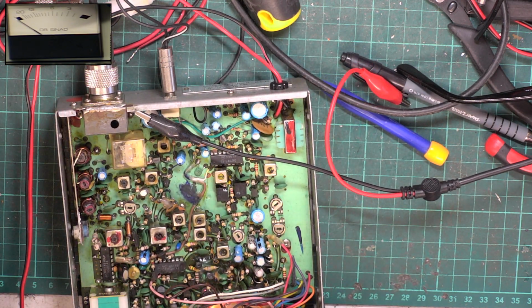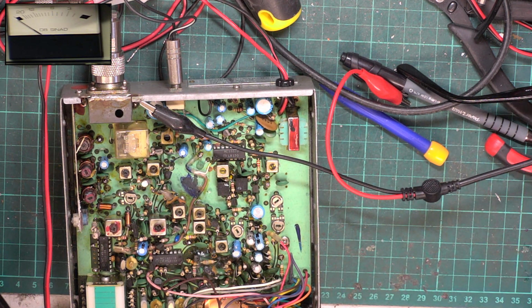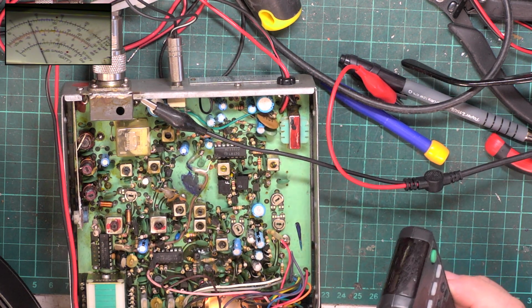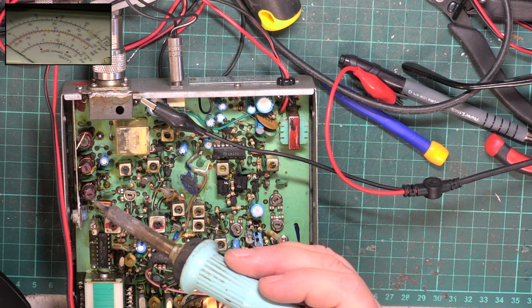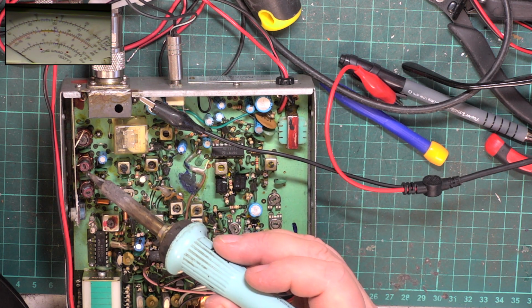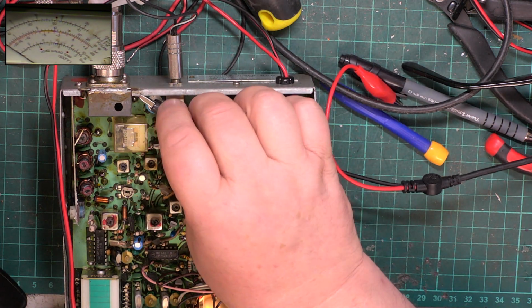Came out of a Midland 100M illegal AM set, so that's... oh, we're on the wrong screen. And now we're getting a full 4 watts, and it peaked at 5 as I tuned it up, so that's satisfactory. We'll just melt the wax back on these. I'll put the spectrum analyzer on. We'll just look for any naughtiness of signal.